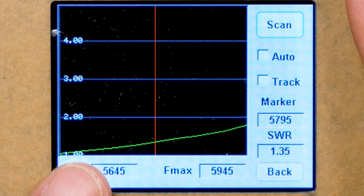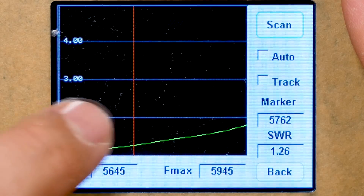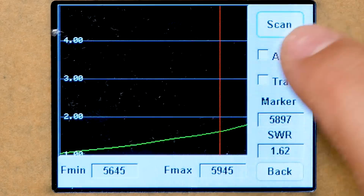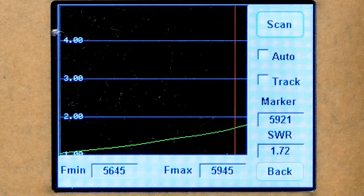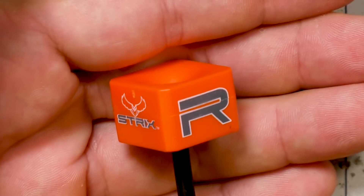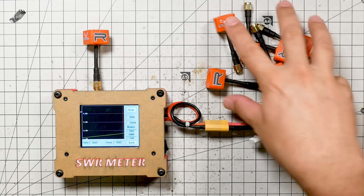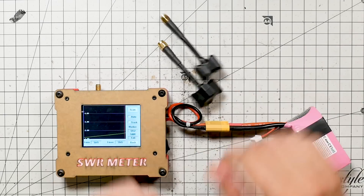What this is telling us is that this antenna is better at lower frequencies — the lowest frequency here is 5645, and I can tap on the screen to move it around. We can see this antenna is a little bit worse at higher frequencies. For the RF guys looking at this going 'a SWR of 2.0, that's atrocious' — remember, this is not a high precision device. The idea is that we get a rough number. We don't actually know the real SWR of this antenna; we just know it's a little bit better on lower frequencies, a little bit worse on higher. We look for things like consistency. I've tested all eight of these Hoot antennas and they all tested out about the same. So now let's test some other antennas.